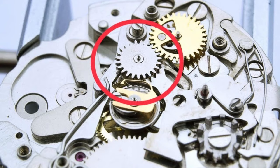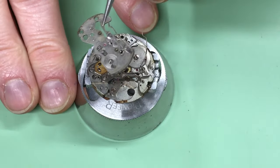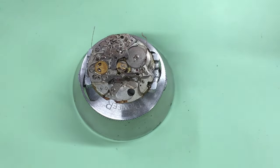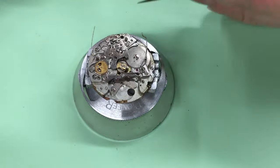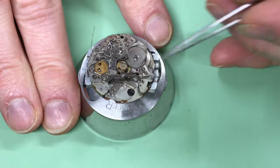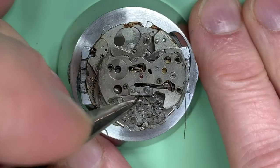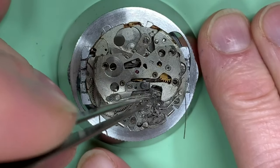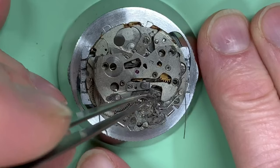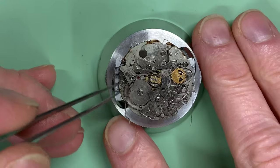Back to the video — we did hear a click, and that was this lever here, which goes around the hammer. I didn't release the tension on that, which I should have done. It just lips over there. Before you take the screws out, pull it towards the movement and up a bit so it goes over its post and isn't under any tension. Sorry about that.